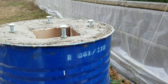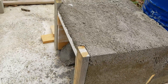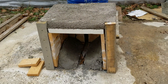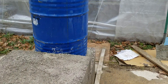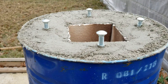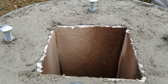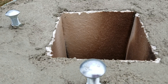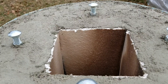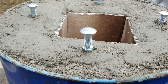Today is January 24th, 2019. This is what we look like so far — haven't really done anything with the inside yet, we still need a door. I finished mortaring or cementing the barrel in. This is an eight and a quarter by eight and a quarter, give or take a smidgen, ceramic insulated panel, two inch, surrounded by a perlite mortar mix.